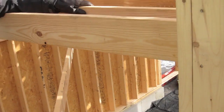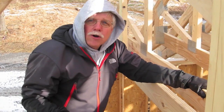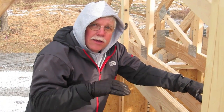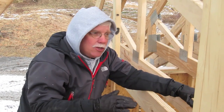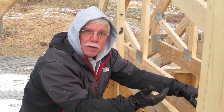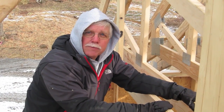Well, here in New Hampshire, in the Northeast, it's a very common thing. They're called transom windows — a really neat architectural feature that's been around for hundreds of years, and they allow a lot of light into the garage. Because they went with extra tall doors and then the transom above it, you had to raise the bottom of these trusses up so that the transom would still be inside the ceiling, below the ceiling of the garage. That's why the trusses had to be made that way.